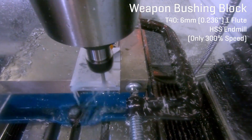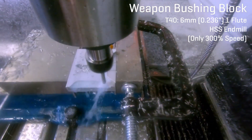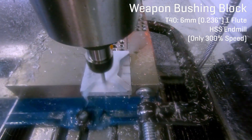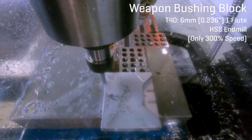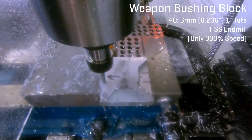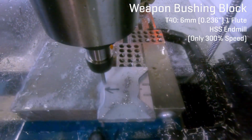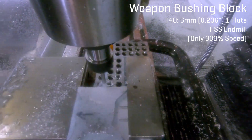Workholding is a problem not only for holding, but for precisely locating the part and its features. You need a way to either keep the part in a location and orientation where the machine can place all the features you need, or have a way to probe the part or another area of your setup to find exactly where to go. The Shapeoko machines have an XYZ block add-on for this, but the Tormach doesn't. There is a 3D passive probe which is on the way, and I'll be using that in the future, but that thing costs $400 — that's half the cost of this entire robot. You can also use an edge finder or dial gauges for this purpose, but that's incredibly tedious and slow, although it will almost certainly prove more accurate than what I'm doing here.